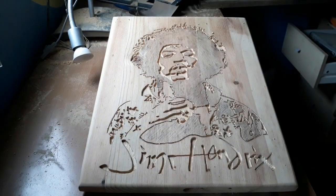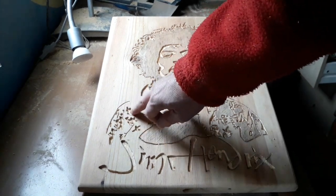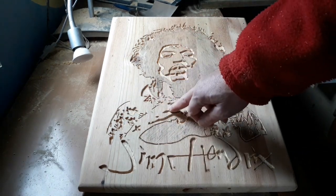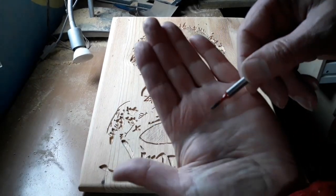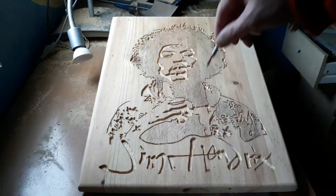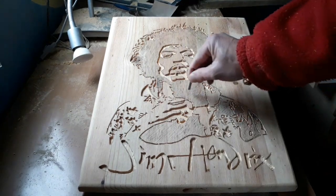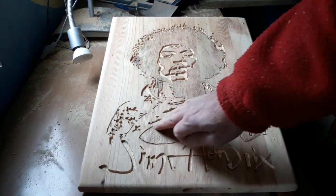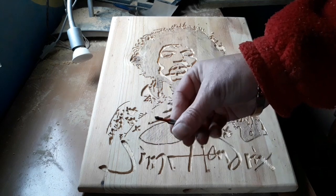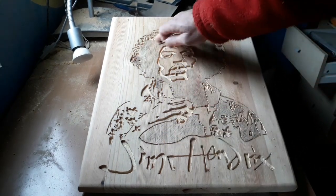You can see we've gone around with the little CNC bit. Most of this I've taken out with the CNC bit because it's so small I'd definitely struggle to get the double-sided blade in. What I'm going to throw on now is just this little one-eighth bit — a single blade — just to take out what's left. I'd be quite happy doing the lot with the CNC bit because it's popping out really nice and quick, but this will help get it done a bit faster. So we'll pop this in the router and take out what's left.